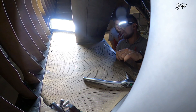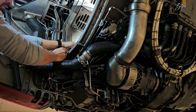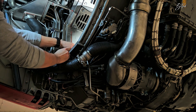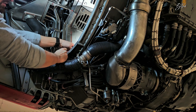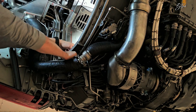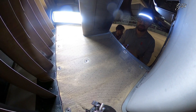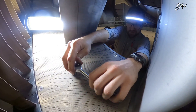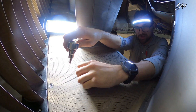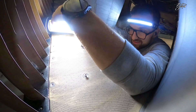The first job is removal of the acoustical panel, which I have already started. It is held in place by four screws and three bolts with nuts. Two of them are quite accessible, but the third one — which is close to the strut at six o'clock — is a bit hard to access because of the anti-ice duct. With a bit of skill it is possible to remove it. One important note: if you find any of those screws untorqued, they need to be replaced — you are not allowed to use them again, so keep that in mind.